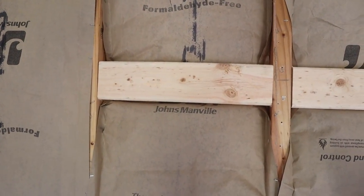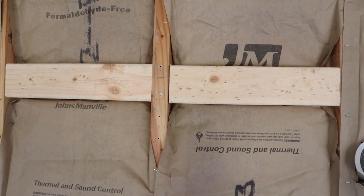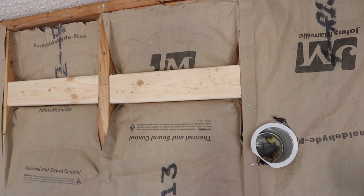And like that, 30 minutes later, the problem is fixed. We've got some nice wallpaper covering. Sure. And we're going to cover it back up with drywall. So two things you may be wondering. One, what is this up here? This is our blocking for our mini split air handler unit that goes in our bedroom. We have mini splits in the house. This is the blocking to support it and to mount it. Likewise, this little tube here, that's what goes through the wall to the outside. And that's where the compressor lines, condenser lines, drain lines, power line all go through. So that's what that is.